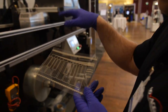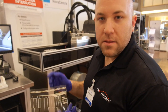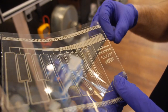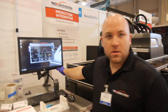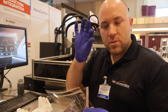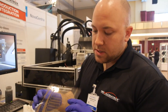Actually we can do much faster — we're just set up here at the trade show so we don't want to make too much noise or mess. But this kind of setup usually runs at about 600 feet per minute, so you're making 20 or 30 per second. This one would be connected to some kind of electronics — you have a connector here called a ZIF, a very small connector, and a small device which interprets the signals, so you need a little microcontroller, a very cheap, very common device. The application would be to do a switch — instead of making a movement to make contact with a circuit, you just make a little change of capacitance. It's a much cheaper switch with absolutely no wear and tear, because there are no moving parts. This part is less than a fraction of a penny — it's just a little piece of plastic and a couple hundred nanometers of silver ink placed on top.